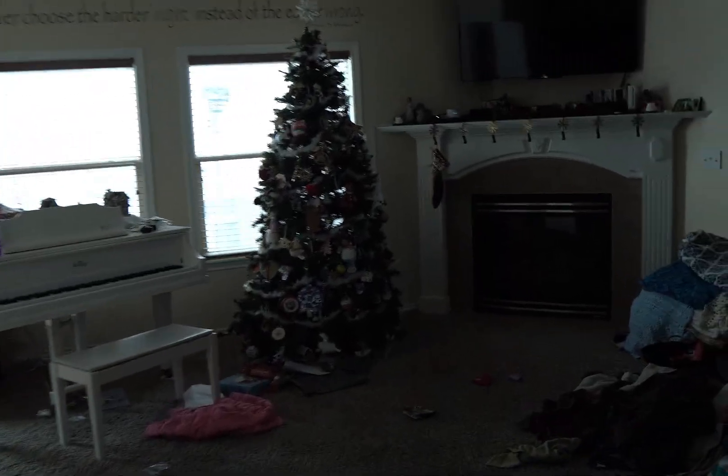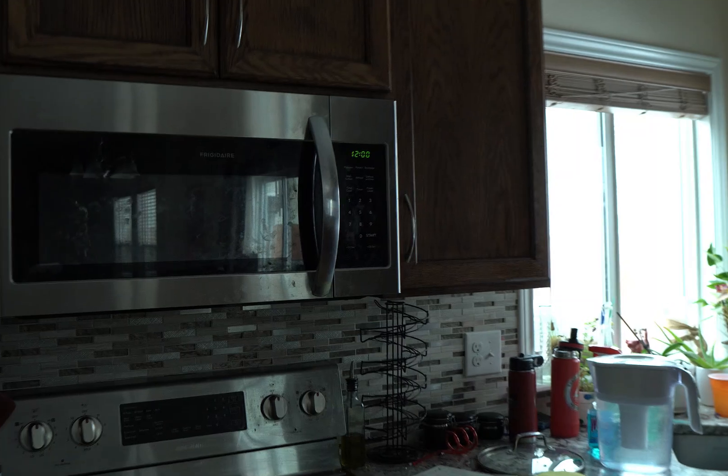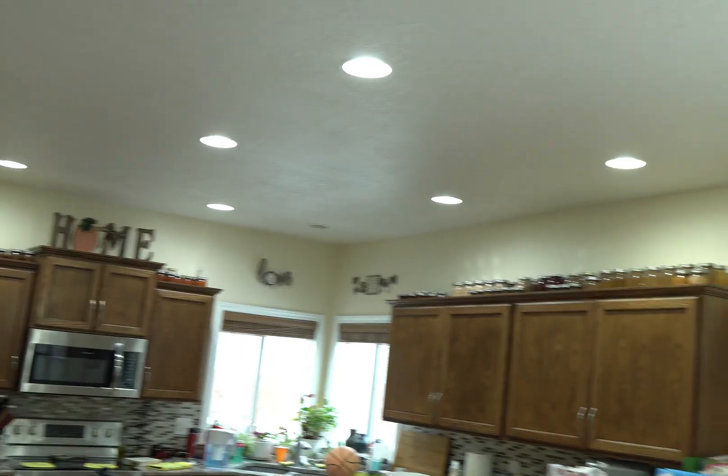Let's go see. It's dark in here. Power to the fridge, microwave's blinking — it's getting power. Range is still off as I turned that off. Let's check the light switch. Look at that! This project is a massive success. I've got lights on in my kitchen, a microwave that'll work as long as I'm not running it at the same time as the oven or the dryer, and my furnace is even currently running. It's powered mostly by natural gas, so it only needs enough electricity to run the air handler — basically a fan that blows warm air through my house, which my generator can totally power in addition to the lights and everything. So I've got heat, I've got light, I've got everything we need, and I'm doing it safely. I don't have to have a window or door cracked open to let extension cords through. This is the kind of project that's going to make your home substantially safer, and it's a project you could totally do yourself, or at least most of it.